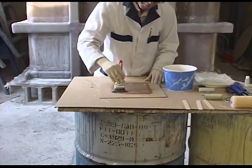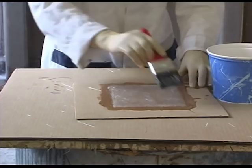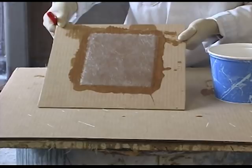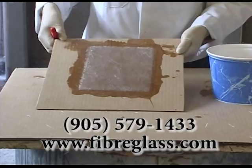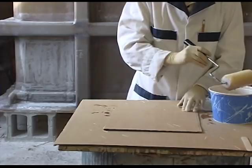There it is, folks. In a matter of 20 or 30 seconds, we've got 2 layers of 1.5 fiberglass laminated with a general purpose unwaxed resin. You could use that material there for a car repair. Again, the difference between the two brushes is the chip brushes are less expensive. They take a little longer to use. The Go brushes work a lot faster. In this application, we're going to use the big fuzzy roller, and we're going to be laying up a 3-layer pass of matte roving mat.